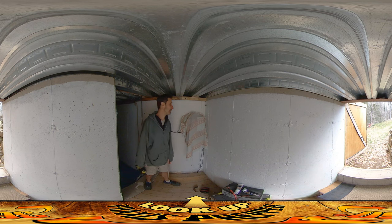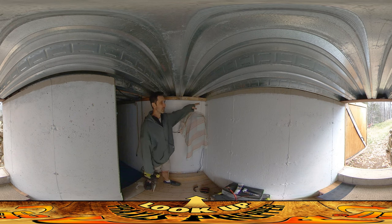Why am I upset about that? One, I just put glue here, so if I'm working over here I have to watch out for the glue and avoid getting dust on it. The bigger issue is I did the hydraulic cement last night — I could have had both holes curing and I didn't. This one's all cured, but if I do another one now, I'll have fresh hydraulic cement that needs to set before I can bury the line. And if I don't finish today, tomorrow I'm completely booked, the day after that I'm completely booked — it'll be the third day before I can come back.